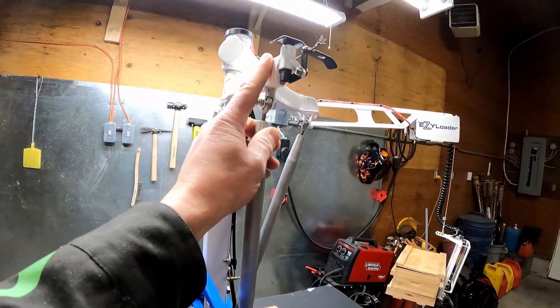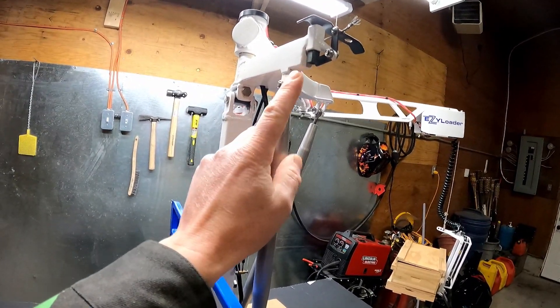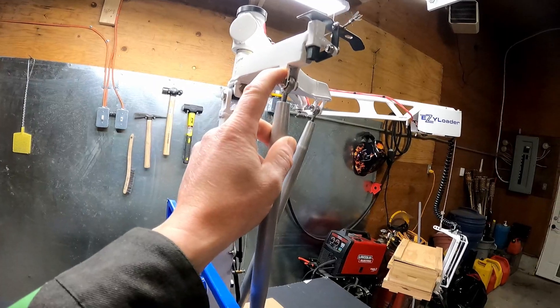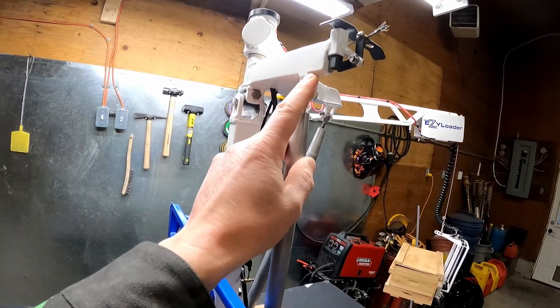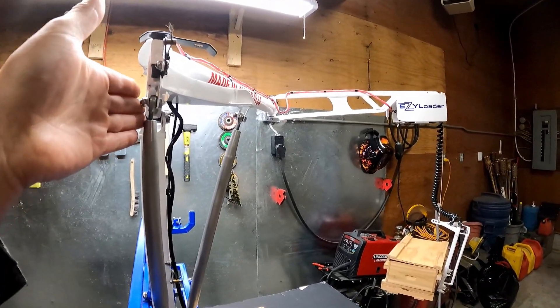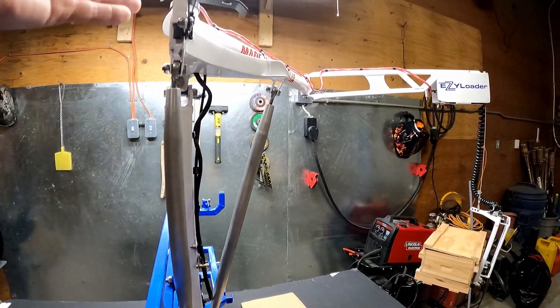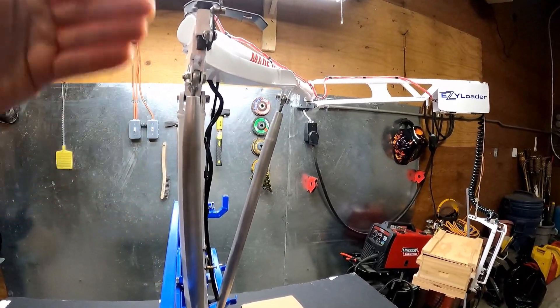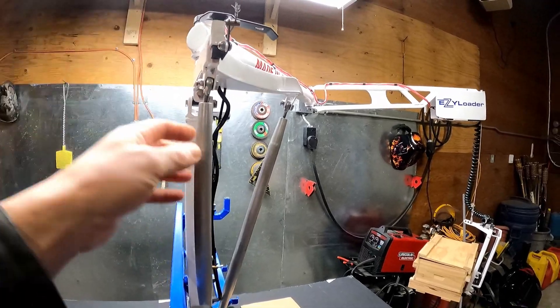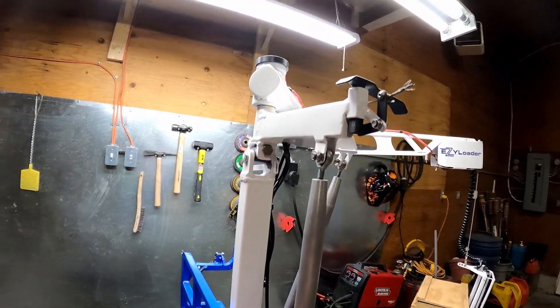When we look up at the triangle here, this triangle at the end is around 2,400 kilograms of tension and compression on these points. So depending on where it is in its swivel, you're either going to have tension and compression one way, or you swing it around the other way and the tension and compression completely changes over. So it's important that this triangle is built well — and it is.